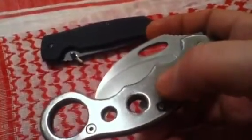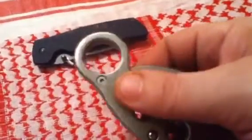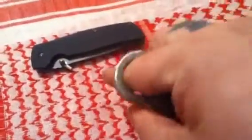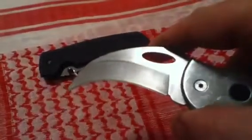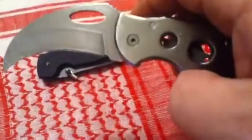Here's another mod that I did. I completely sandblasted this entire Karambit down. It did have what they call deer camo on it — this really hillbilly, woodsy dark and light green camouflage. Didn't like it at all, so I sanded it down. I also increased the inner diameter of the finger ring so I can get my big old honking fingers in there better. I also sanded down the blade and took off the bead blast finish, to give it more of a raw, used look. And I also took the first finger groove right here and deepened it more to access the liner lock better.